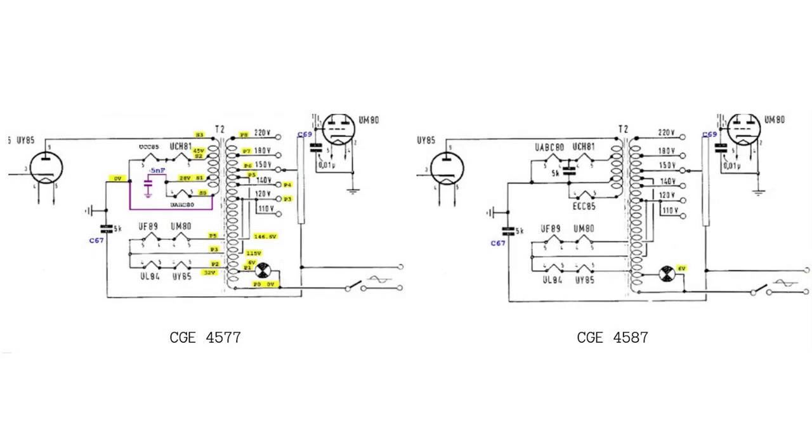This radio model, and also the successor, have a power transformer used as isolation transformer, but also as autotransformer. In practice, the secondary winding, isolated from the mains, provides the AC high voltage that is then rectified to get the B+. But the tube filaments do not have their own winding, and they are connected in couples, partly to the secondary and partly to the primary winding. In other words, 4 tubes out of 7 have their filaments powered without isolation from the mains.